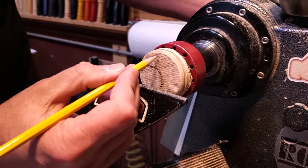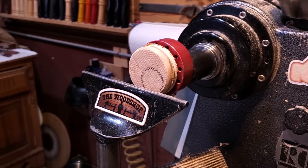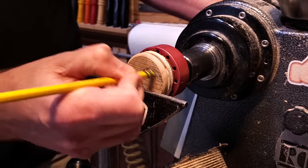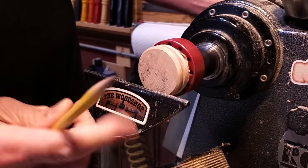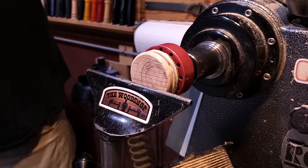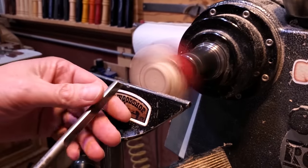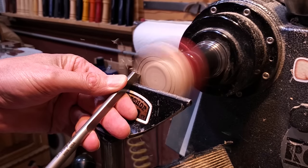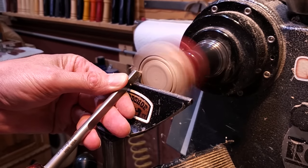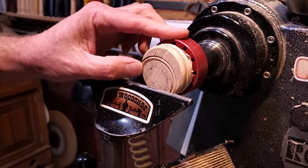Because the beading is going to be cut in air when you get out on the edges, crank the lathe up — I turned it all the way up to 3,000 RPMs. The first cut — actually that's a little close. I'm going to erase that because I don't want it to cut all the way around. I'm going to move it out here a little bit. The lathe is up to 3,000, everything's good. You can see that line I just put up there. Once you make your first bead, you know right where that line is and you can just keep working your way down.